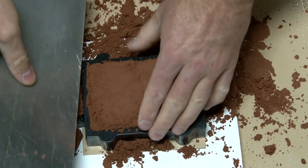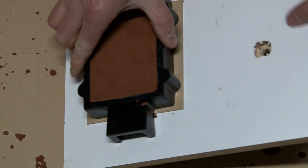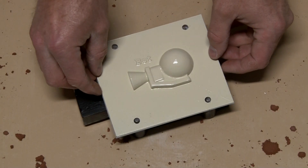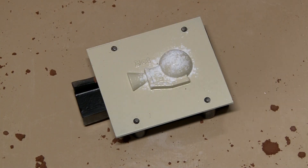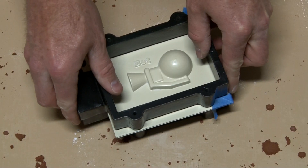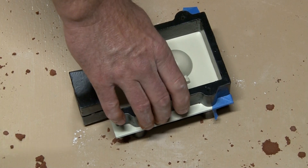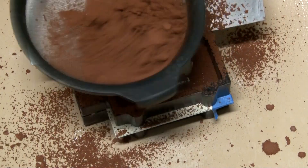I'm abbreviating this whole portion because we all understand how to pack sand in a mold — just keep adding it. Here I'm flipping it over and pulling it off the special plate I made with holes so I could put the flask in the match plate. Now I'm adding the second match plate. I bought two identical casting flasks but the company didn't drill the holes and put the pegs in the same spot, so I had to oversize the holes on my match plates. That's why I'm using blue tape to realign and hold them together.